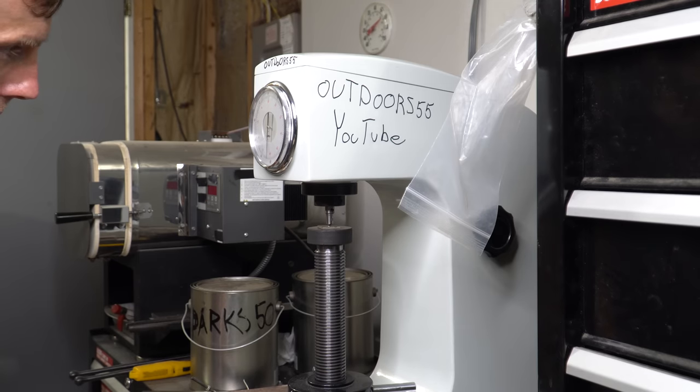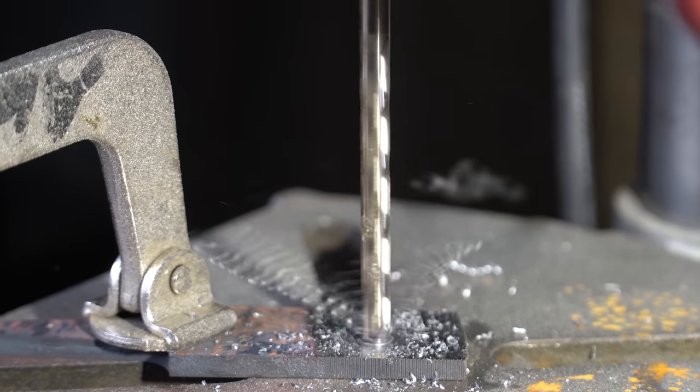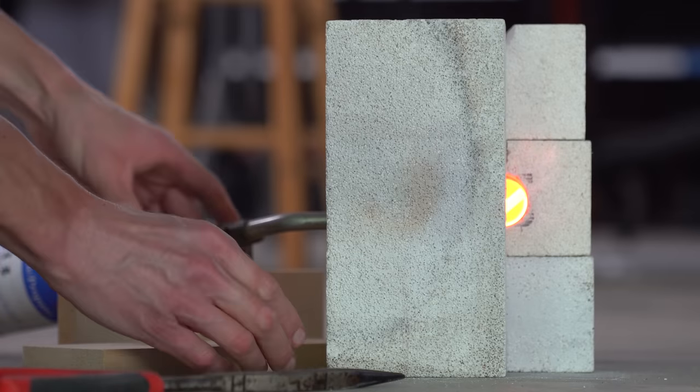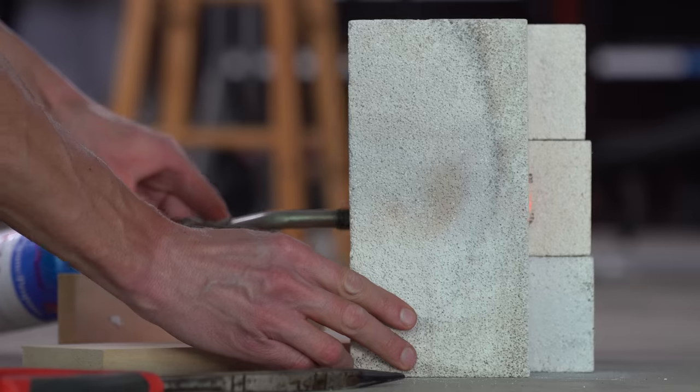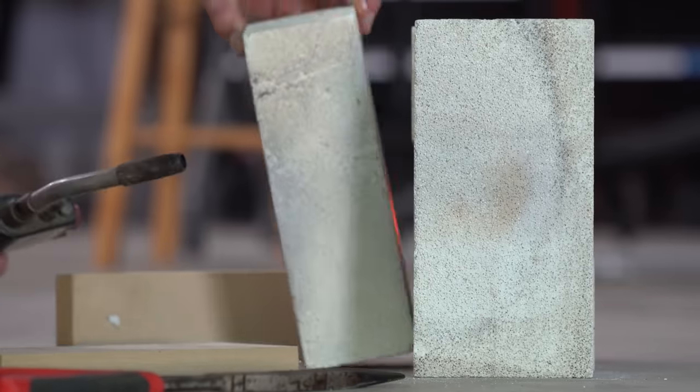They can also be roughly annealed in a kiln or a forge if you wish to drill holes or make it easier to grind. The annealing process is fairly simple: heat the forge or kiln up to approximately 1550 degrees, then leave the kiln or close off the forge so that no air escapes and allow it to cool as slowly as possible to room temperature. The slower the cooling rate, the better the anneal. This isn't technically a full anneal, since a full anneal requires knowing the exact steel type, but for a file knife you can get a pretty good anneal doing it this way.